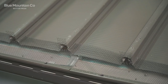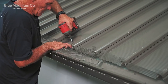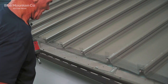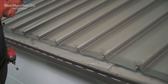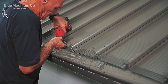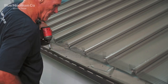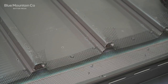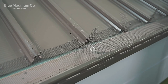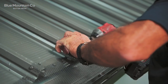You can see there we're going to get really good coverage over those end caps, which is especially important if you're installing in a bushfire zone and if you're putting two millimeter mesh on. You can see here the screws that we're putting into the pan in the corners of the mesh. This is why it's so important to make sure those screws are overhanging the gutter, because that's not typically what you do when installing a roof sheet — best practice is to put them in the top, but in this instance we put them in the pan because we're overhanging, so it's pretty safe.